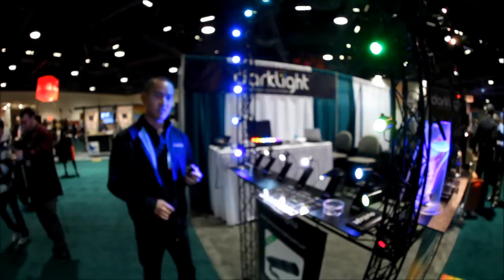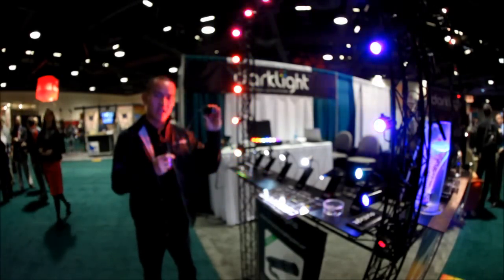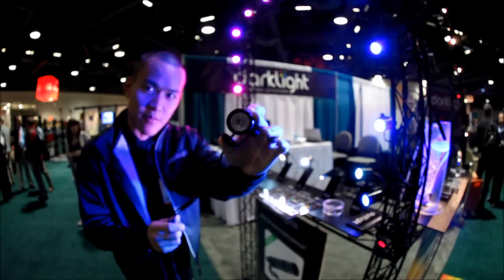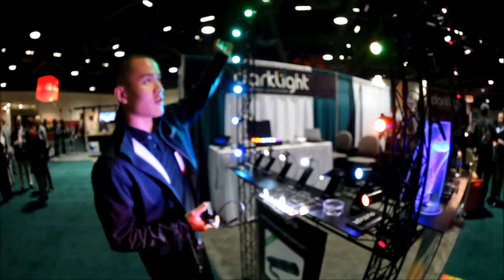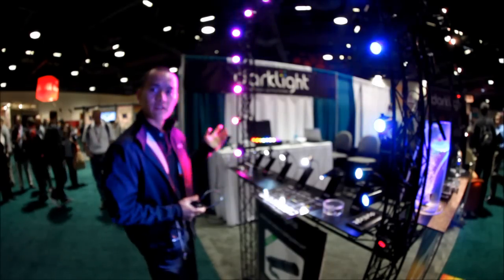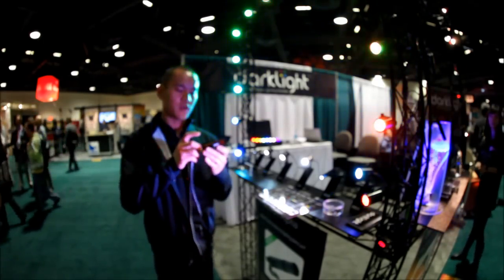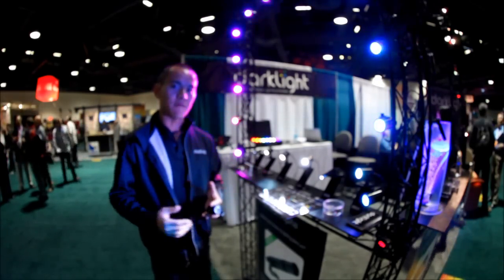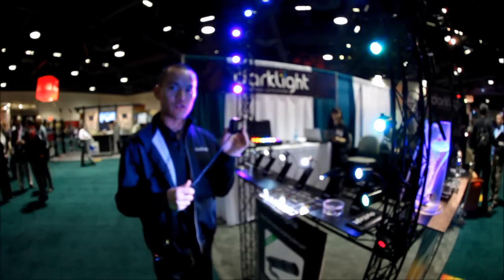What I want to show you today is called the Precision DMX. You can see a fully contained spotlight right here that's RGB, seven channels, DMX compatible. You can see all around the truss right here, I have some of these lights being demoed. Full color range — this has all the intelligence built into the fixture, so you're not talking to a centralized box to feed your DMX signal. You're feeding it directly to each individual light.